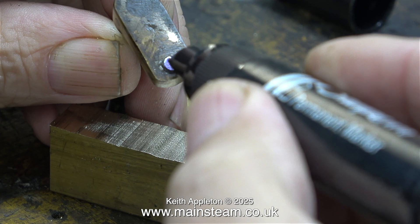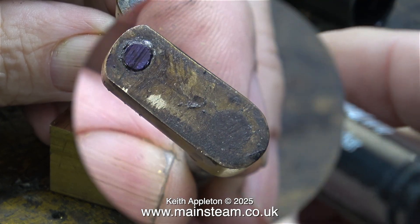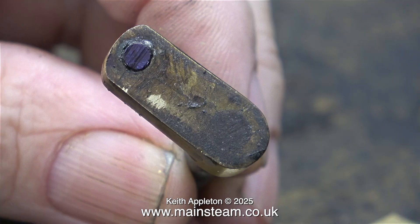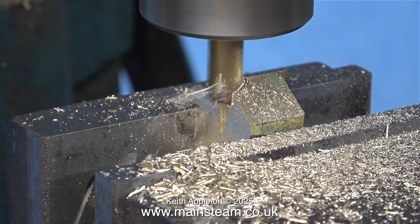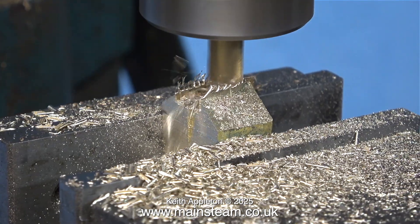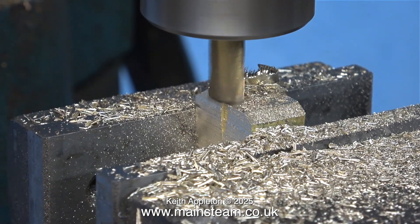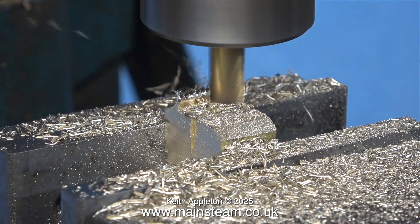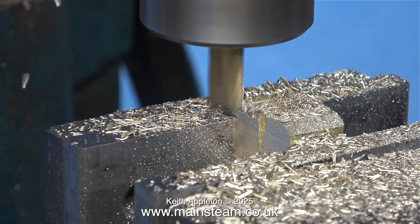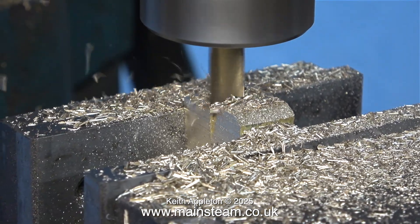In this clip, I'm having a close look at one of the original crankwebs, and I can see the scratch mark where the crank and crank pin positions were originally marked out. For now, I'm not too concerned with making the crankwebs. What I'm trying to show in this video is how to make two accurately sized parts from something that is not accurate in the slightest. A piece of brass cut on the bandsaw will eventually end up as two pieces exactly the same as each other, so they will be able to fit together in a four-jaw chuck and drill and ream the centres.